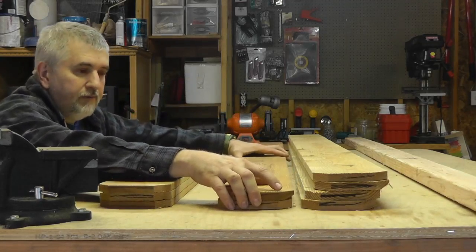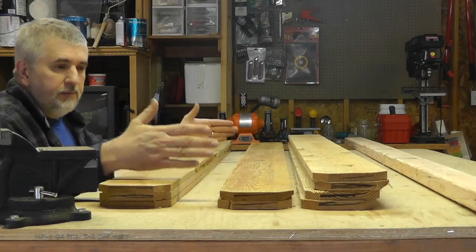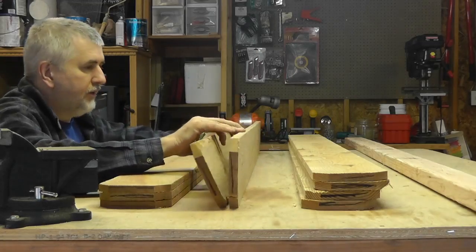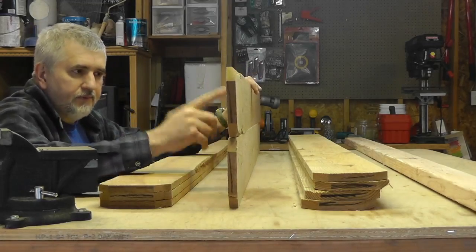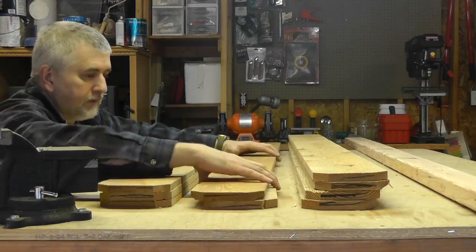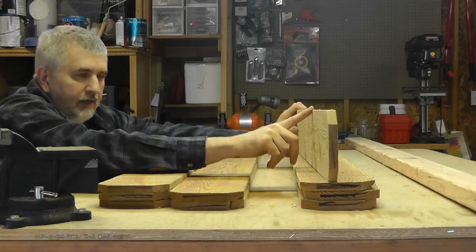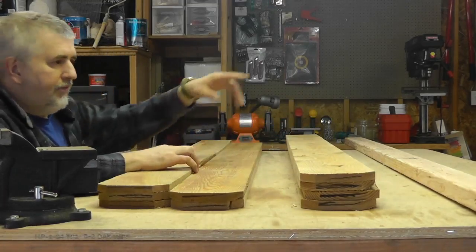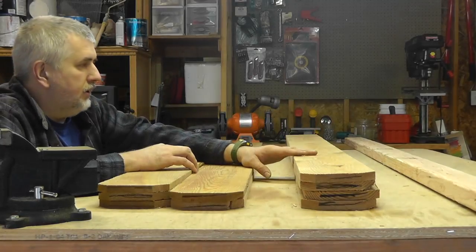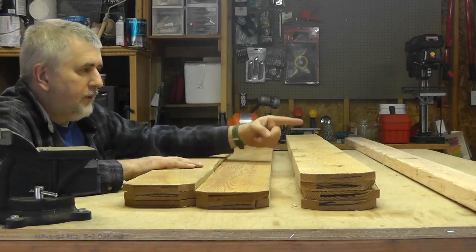The front is going to be four feet wide — the box is 35 inches deep from front to back. I'm going to take two boards and cut them at four foot, which gives me two pieces that at five and a half inches each will make the front 11 inches high. For the back, it's going to be 22 inches, so I'll have four boards cut at four foot for the back. That's where all nine boards come in. I also got some economy-grade two-by-fours — basically the junk with knots — and I'm going to rip those in half to make two-by-twos for the lid frames.